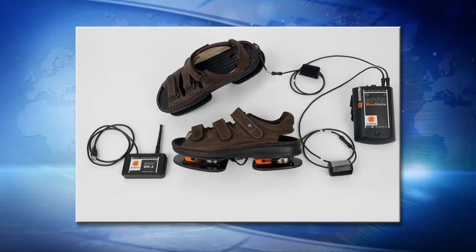What would decide if they're performing well? What we're going to look at is whether, when we take a static load measure at say 50 pounds three or four times in a row, it gives us that same number. We're not really interested in calibrating the exercise machine at this point — we just want to make sure we dial in the same load every time to confirm the load measure is repeatable. Once we decide the tool is working appropriately in space, then we can go back and do some fine tuning. Right now, we're just making sure the tool works.